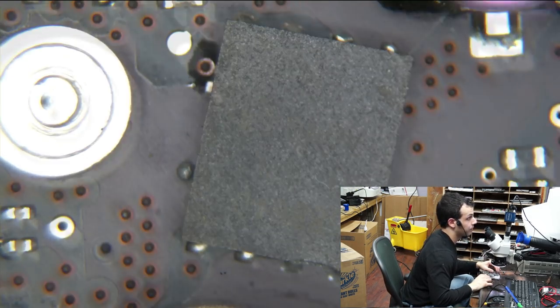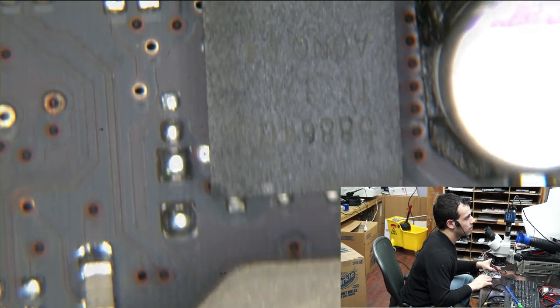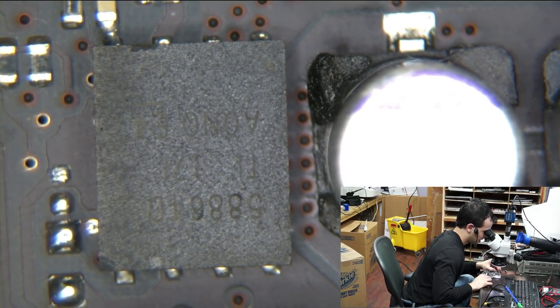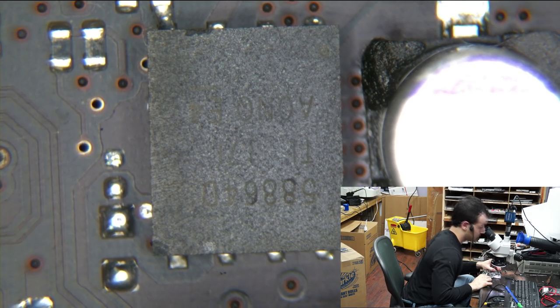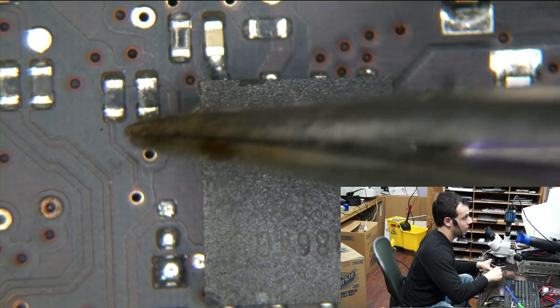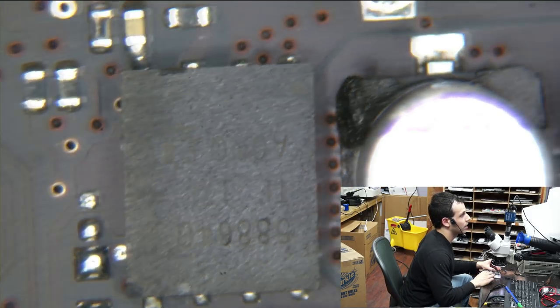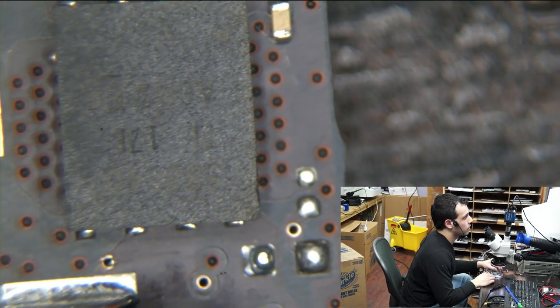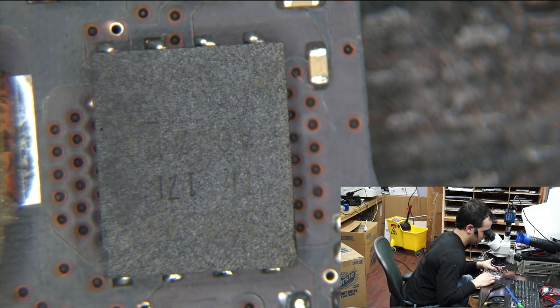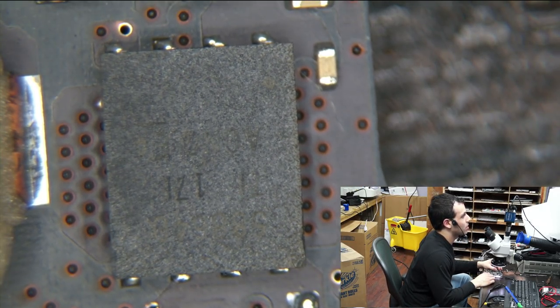So this is Q7510 over there. That's new. That is Q7520 over there. That is new, and yeah, that capacitor got shorted to it, but apparently it's all one plane, so I get to not care. This over here is Q7550. That was replaced. Not exactly my finest soldering job, I'll admit.